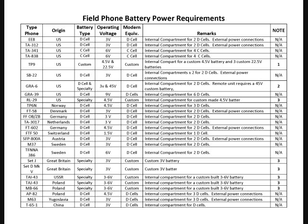Where it gets into the craziness is a lot of the British phones were designed to operate with a square-shaped 3-volt battery. The British phone doesn't have binding posts — it's got wires with loops that fit on the battery, which had little binding post screws you'd just screw a cap off, put the loop on, and screw it down. Then you get to the Warsaw Pact — the copies of the FF33s, the TAI-43s — a lot of them had small binding posts where a big square battery with wires attached would hook on and you'd tighten toggles to secure it.